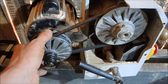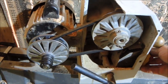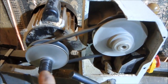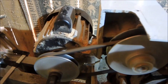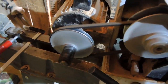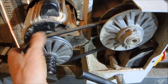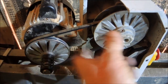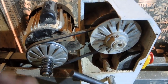Now here is the small diameter, and here is the biggest diameter, and this is 500 speed. And look how I change the speed, what happens. Now this is going there and it's smaller and this is bigger. Now it's on speed 2000 and you can see how the position changes. These two wheels go nearer and it's a bigger diameter, and here this goes there and here is a smaller diameter, and like this the speed changes.